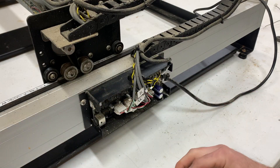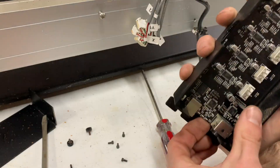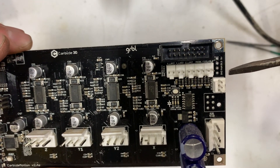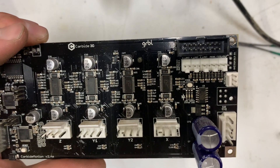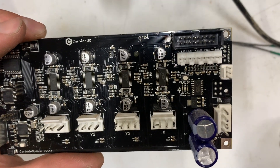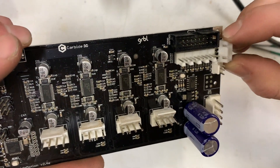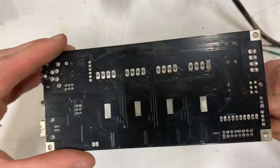The first thing we need to do is crack open our Shapeoko's control board and find an output we can hijack to trigger our plasma cutter. In the top right corner of the board you'll see two pins labeled ground and PWM. These are meant to be used with an optional speed controller for a router but they'll work just fine for us. I'm just going to solder in a little four-pin connector so we can tap in as needed, and then we'll put this thing back together.